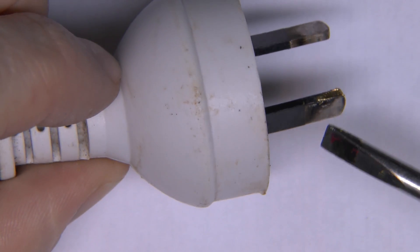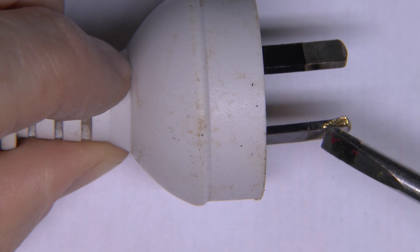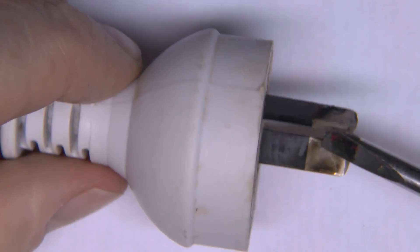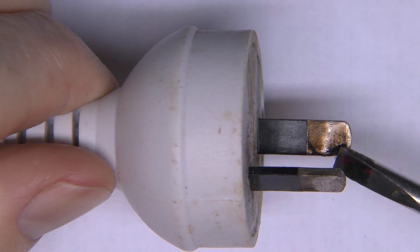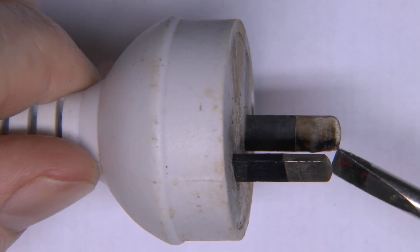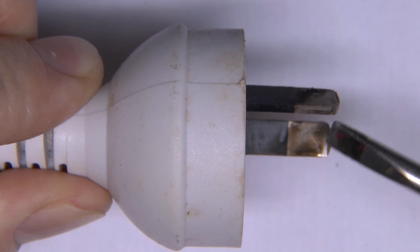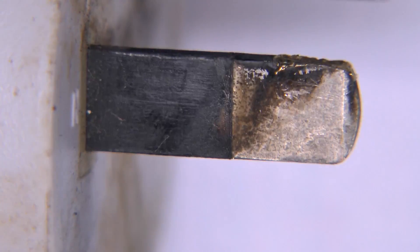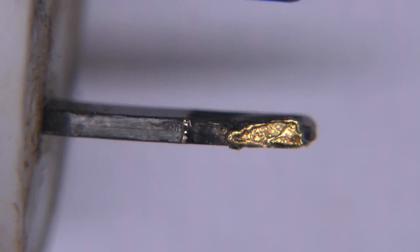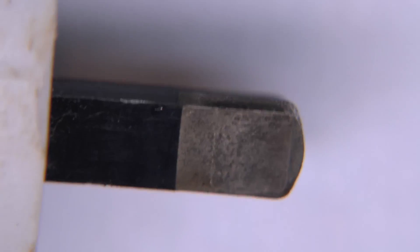Here's the plug, and certainly on this pin here you can see the actual metal has been partially welded — either to the contact in the base, or that part of the pin where the top has basically been pulled off. And there's actually a bit of a mark on the other pin as well. So it definitely looks as if that pin there has partially welded, or at least got stuck. And then it was either welded on due to overheating, or the action of pulling it out caused the arc flash to go across and basically melt away that bottom edge. You can see that's not level at all, compared to the other pin which is pretty much flat on both top and bottom edges.